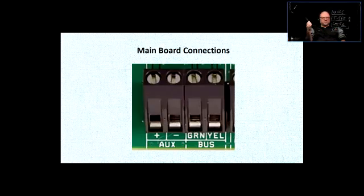So that's all. And those are being mounted. So the switch could be mounted on the door frame, and the magnet could be mounted on the door itself. So when the door opens, the magnet goes away from it, the switch opens. When the door closes, the magnet goes into close proximity and the switch closes. It's a passive device. Right?